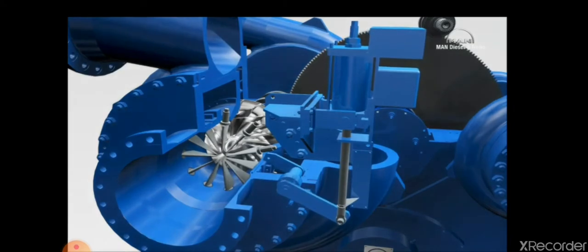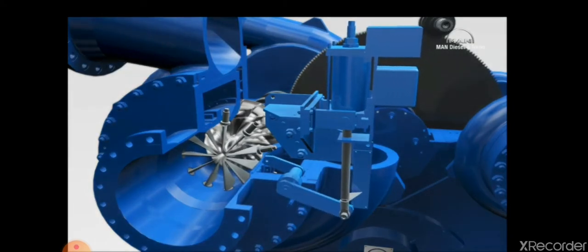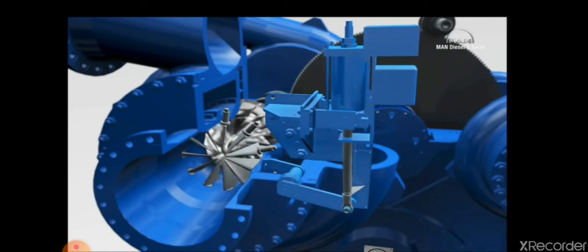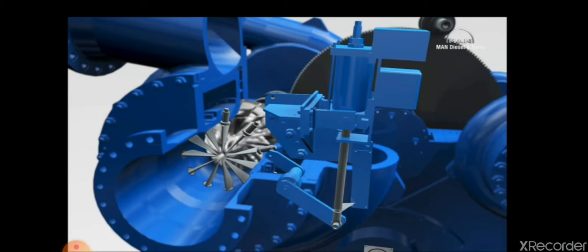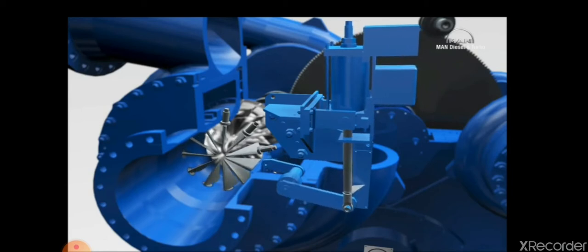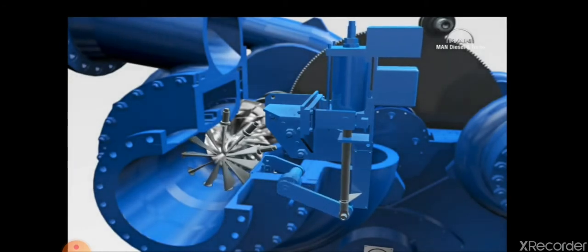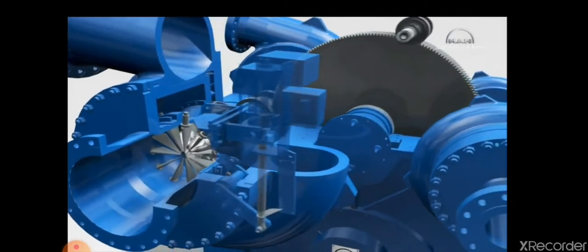Each stage contains an impeller, and each pair of stages with the same impeller speed is arranged opposite each other. They share a pinion shaft, at the ends of which the impellers are attached. Inlet guide vanes are mounted in front of the first stage of each section, here stages 1 and 3. Their blades can be adjusted synchronously, which enables each section to be controlled individually.